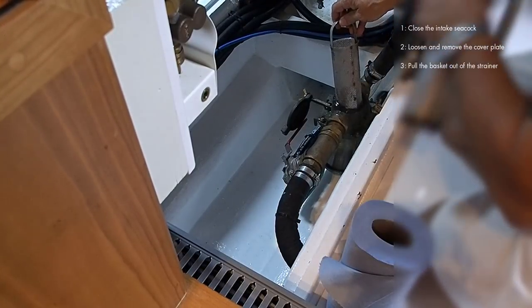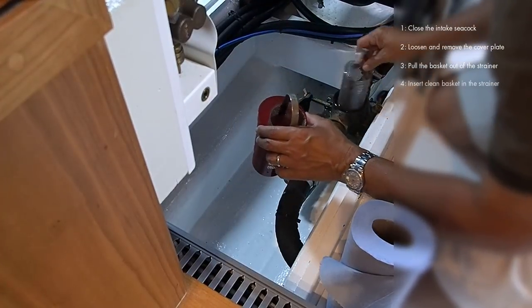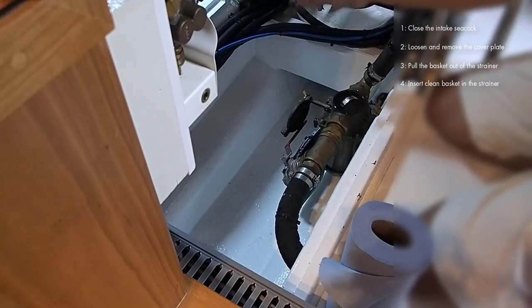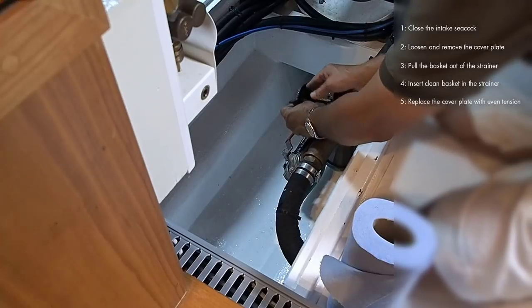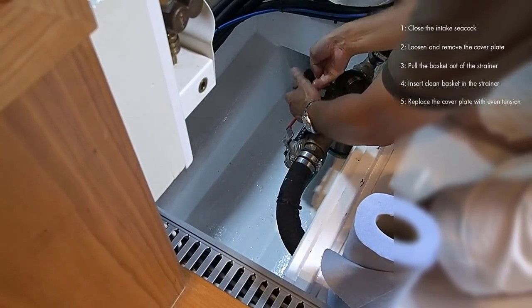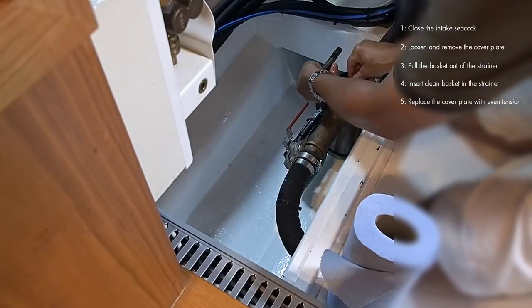You can see that's a little bit dirty. Drop that in my receiver and put a fresh clean one in. We lose a little bit of seawater going into the bilge — we'll wipe that up in a little bit and hose it down with some fresh water. The lid has a rubber gasket on it, so look at that and make sure it's clean and not broken, with no debris caught in there before we try to seal this.